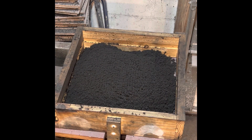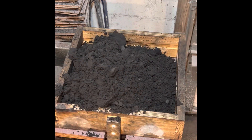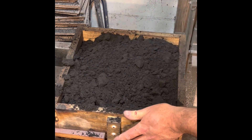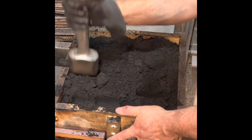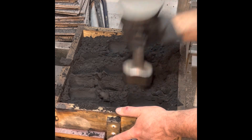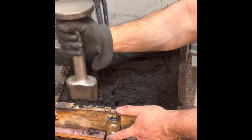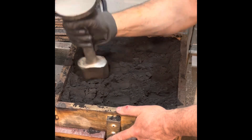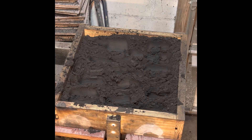Pull this off and add a little more sand. That's a 12 by 12, three and a half inch deep. Start ramming — you start with the peen end, that's the smaller end of your rammer. Since this is mostly flat, you can go pretty hard with it. If your pattern is deep, you have to be careful you don't hit the pattern. You'll notice in the lower left corner, that's where the splash well is, and I'm careful there because that's an inch and a half deep — so if I hit it, I could dent it.